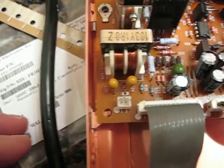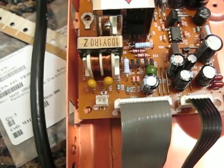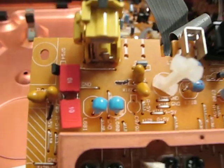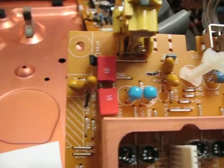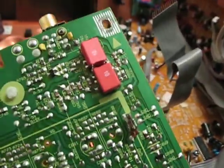I replaced a couple of caps that have to do with driving the spindle motor with some tantalum, because that really needed good coupling — so that made for a really nice spindle motor. On the video board, I've made a bunch of changes. The video output amplifier itself has some really ginormous stacked tantalums. It's also got the video output stage with WIMAs on it, on both sides actually.